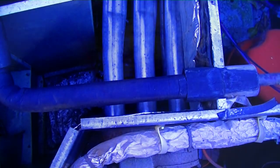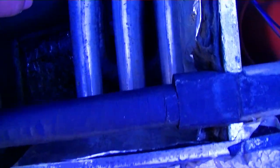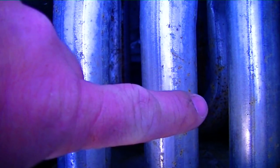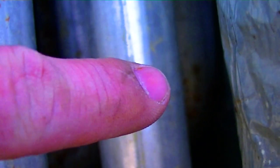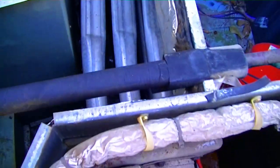Right here on number one, first thing you see when you take it off — there's our first hole, and it's a pretty big one. Bad news. After inspecting further, I found one hole on another tube, and right over here on another tube it's not quite through yet, but it's about to poke through. With even one confirmed hole, the heat exchanger needs to come out. And with the outdoor coil looking the way it does — being so close to the beach — this should really be the end of this unit.